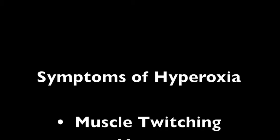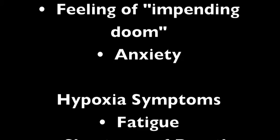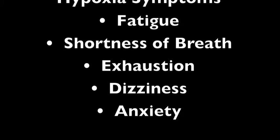During a condition where the loop PPO2 is equal to or exceeds 1.9, the danger of hyperoxia is present. This can result in confusion, convulsions, blackout, and potential death of the diver. Conversely, if loop oxygen levels drop below 0.19, hypoxia can result, leading to the same symptoms and outcome.